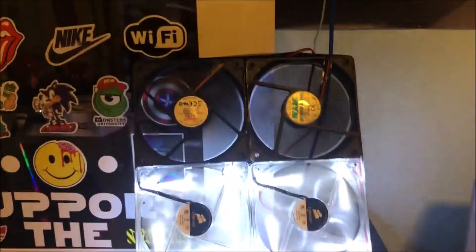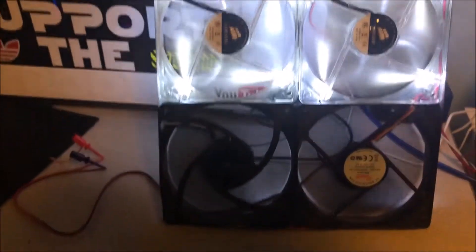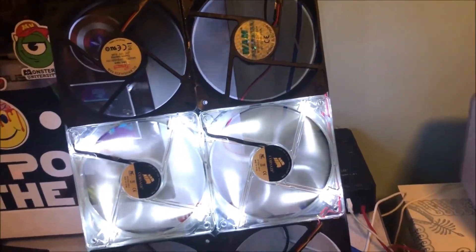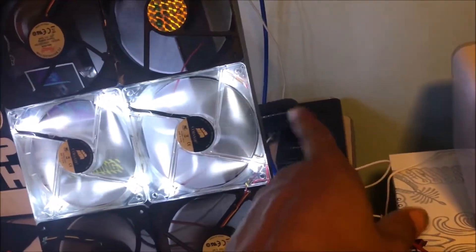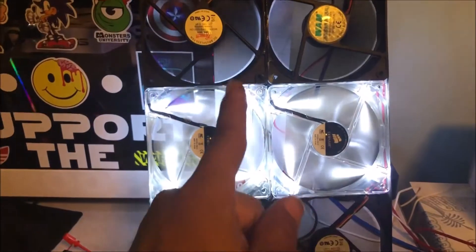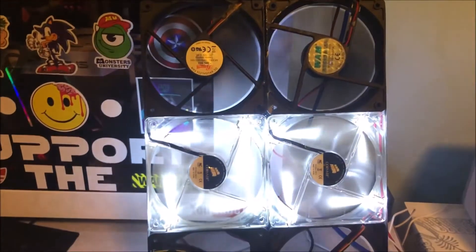So in case you wanted to hook up a bunch of CPU fans together to make a bigger fan — use it on a window or for ventilation — this is blowing air right now. You could set this on top of a roof as ventilation; it's low amperage, running off less than two amps at 12 volts. I used an LED AC adapter, hooked up all the reds together and all the blacks together, then ran a longer wire and connected them all.